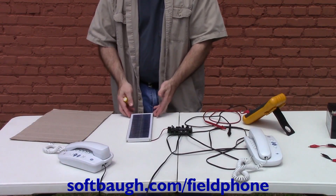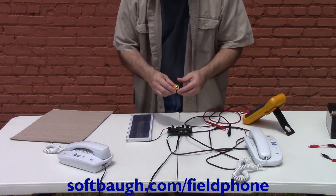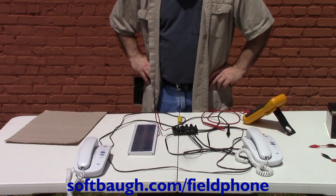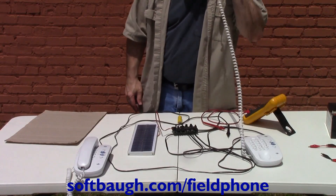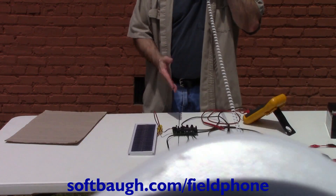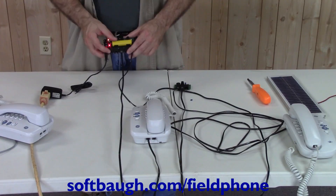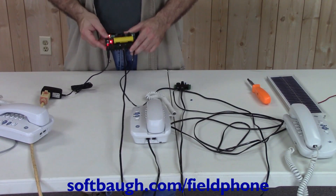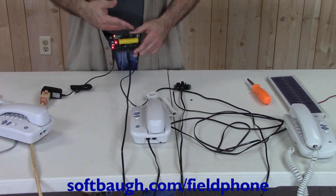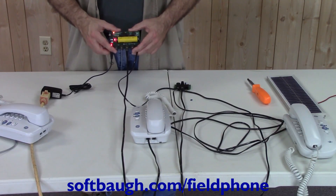Putting the battery back in, it continues to charge. Now we've waited for full sun to hit the solar panel, so we're going to try again — and now we're running off full sun from a solar panel with no battery. As designed, this can also operate as a normal battery charger for a lithium iron phosphate battery in the 18650 format. It charges at about 400 milliamps assuming sufficient input current, and at 400 milliamps it would charge this 1100 milliamp-hour battery in about three hours.